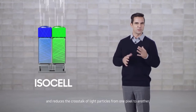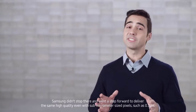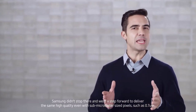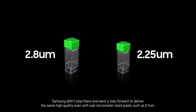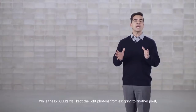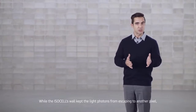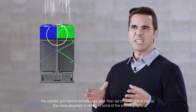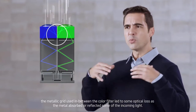Typical CMOS sensors, the most common type of image sensor found in smartphones, are made of four layers: a layer of micro lenses to direct light towards the photodiode, a color filter to detect and separate color information, a metal layer of wiring connecting the individual photodiodes, and a photodiode layer to collect light and convert it into electrical charges. To take high-quality images, each pixel within CMOS sensors needs to hold as much light as possible so it can transmit accurate color information to the image signal processor.